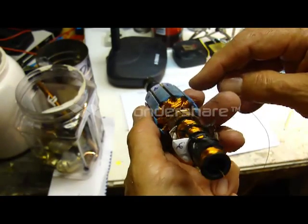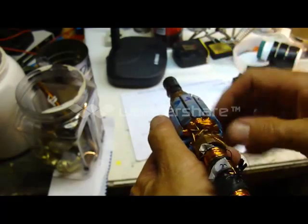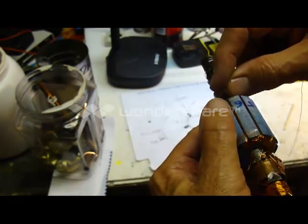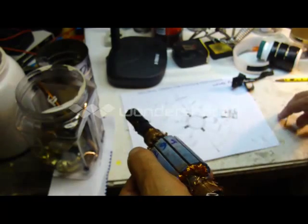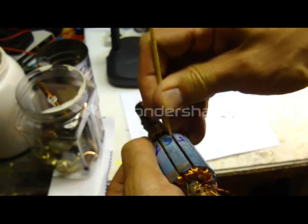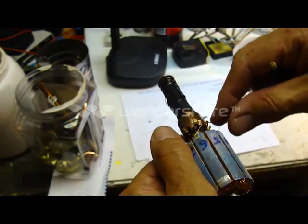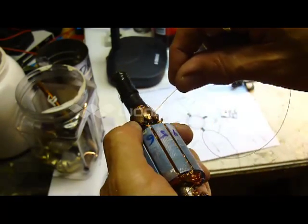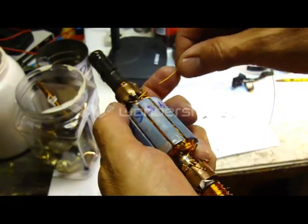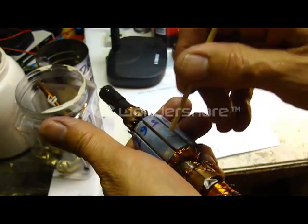The bent pole two goes to four and five. Pole three now will go to five and six for the north pole, north half of that coil. I have already started it here. So now this is the big test — whether I've got the length of the wiring correct as I'm coming in to fill in this pole, north pole around poles five and six, the north pole of this coil.